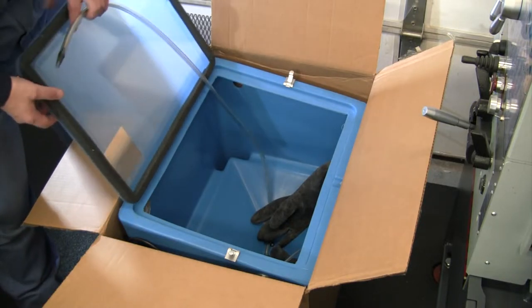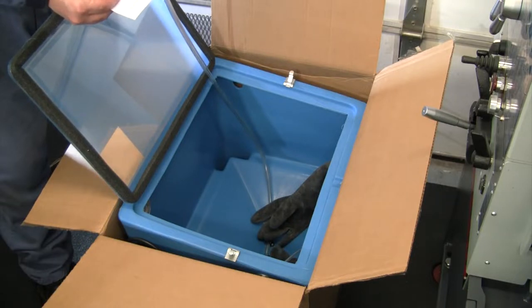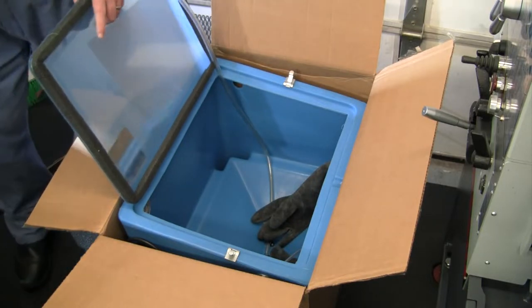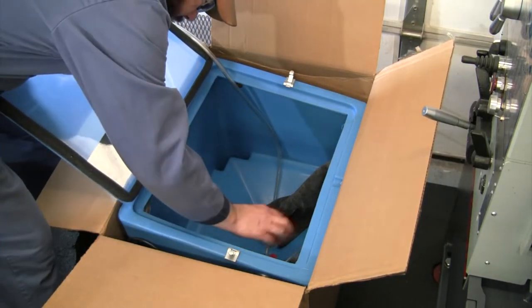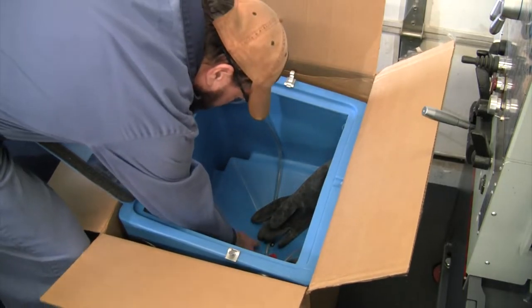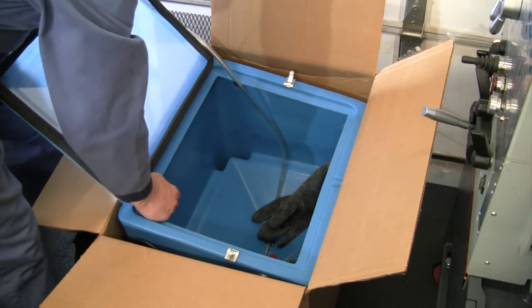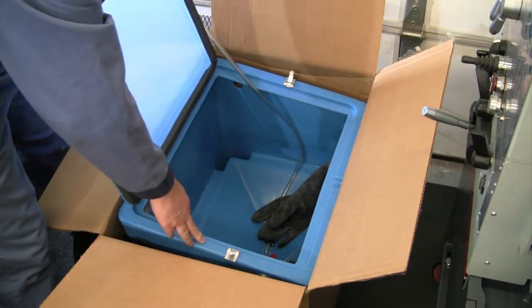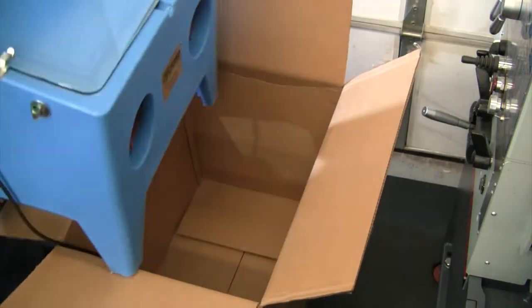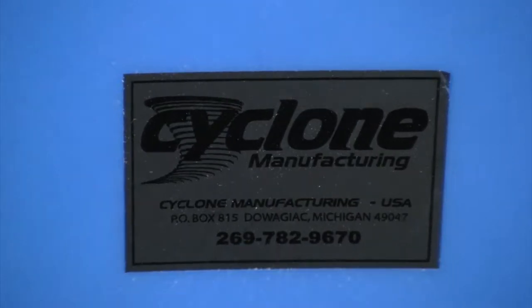With this model, media has to be 100 mesh or smaller. I plan to use 100 to 170 glass beads, which should fit through this nozzle. The gloves are attached with big hose clamps. There's a drain plug out the bottom, some little bits of PVC inside. I'll probably do a quick vacuum of the inside to clean it out.